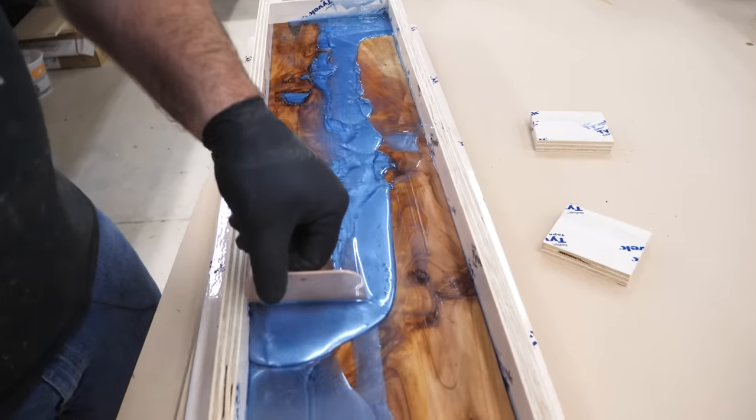My epoxy clear coat cured perfectly — it's time to eliminate the drips. These panels are going to go right over my existing cultured marble, but I'm going to waterproof this 100%. The foam is already water and mold resistant; I'm going to take that to the next level with our Ardex waterproofing membrane — just roll or brush that on, a thin layer is all that's necessary. Let that dry and tomorrow we're going on site to install.